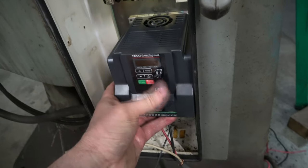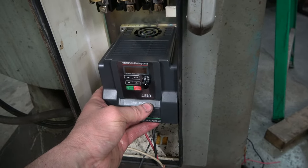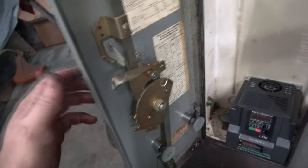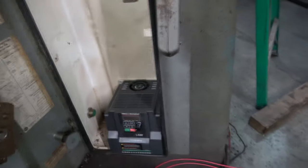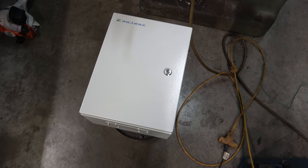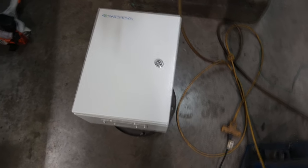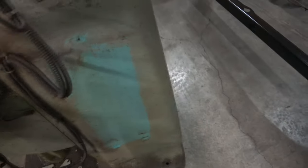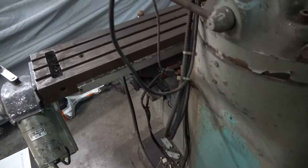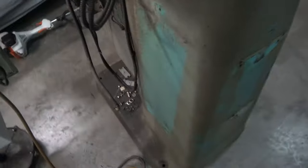I don't know that that door is going to shut — the latching mechanism sticks out enough on the door that it ain't going to work like that. My VFD didn't fit in the Allen Bradley box, so I went ahead and got this project box — it's a little bit deeper. I decided instead of mounting it right here, I'm going to mount it on the back where that transformer was. That way if I have an awkward piece and the knee is low, this box might not interfere with pieces hanging over.